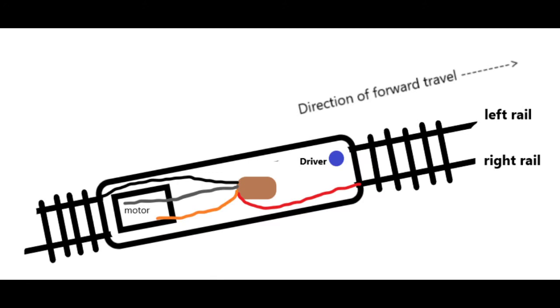This very simple diagram is to explain the wiring of a DCC decoder or a wiring harness. The red wire is to pick up power from the track and traditionally this should be connected to the pickups that collect power from the right hand rail — that is right from the local driver's point of view. The black wire is also a pickup and traditionally this should be connected to the pickups from the left rail, or left from the local driver's point of view.